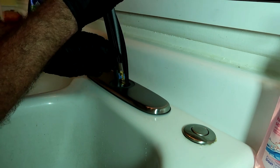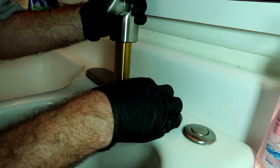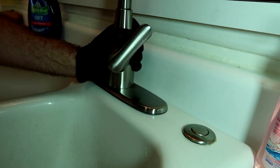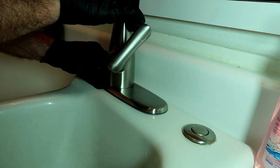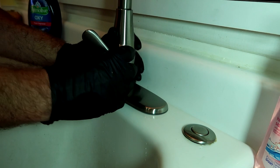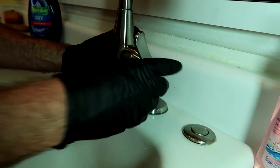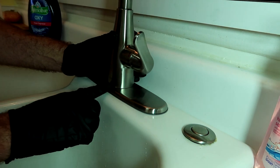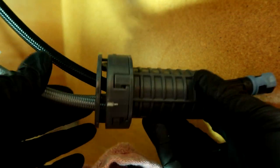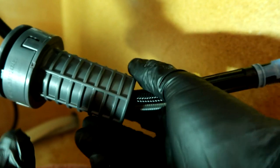Don't forget this little line here - that's from your sprayer. I've never done one of these before, so I thought I'd record it for the first time. Turn it like that so 'Glacier Bay' is showing here on the bottom. Make sure you get your lines through the middle of this as well, because this is what's going to screw up on the bottom of the faucet. It says you can push this up and then screw it - either way, just make sure you've got your lines through there.